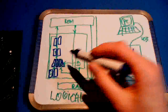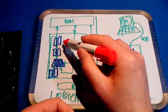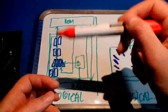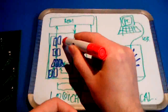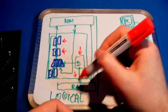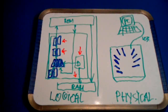Now, we're not going into detail now, but these subsystems are all activated in turn. So first one is activated and then the other one is activated during one cycle. So during each cycle you have a number of activation steps. First this, then that, then that. Next cycle again, first this, then that, then that. So to do that you have a timing module which basically emits pulses to activate also the write to the RAM, to activate subsystems one at a time, so that at every moment no two subsystems are activated at the same time.